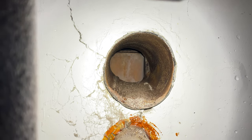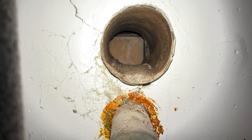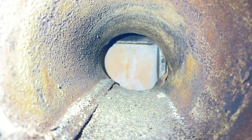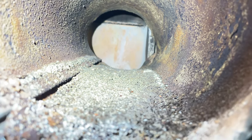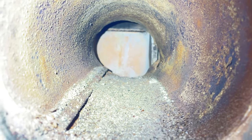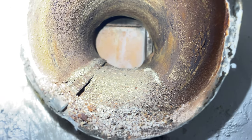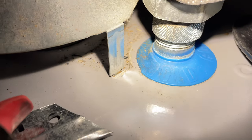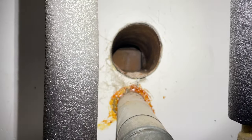I thought we had some venting issues — and we probably still did. This was a clay-lined flue, and I thought maybe it was blocked, but I don't think it's blocked. We're going to pull a liner for this water heater because you can see it's melted — it wasn't drafting correctly.